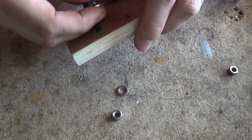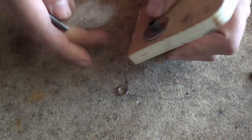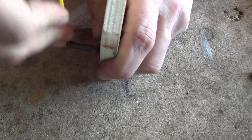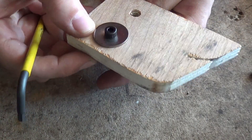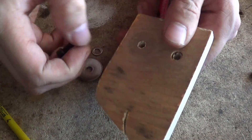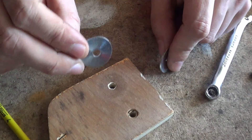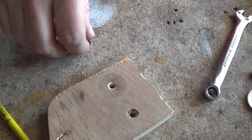If we go one further on this example — nice fresh clean hole, stick a penny washer on it. This is probably going to deform the washer more than it's going to deform the wood. So that's really tight now — you can see it's deformed the washer slightly in the reflection. Same on the back — equal forces. When we undo this, you can see there's an indentation but it hasn't chewed up the hole like the first one did.